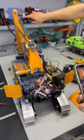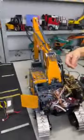So you see, without tanking, this goes to the arm and the cylinder, and then comes back to the cooler to circulate inside, then cooled by the air, then returns to the oil tank. This oil tank, when we're filling up, to be easier, we put the hose. Yeah, we can fill up oil directly. Also, we can suction from here.